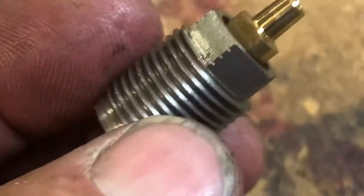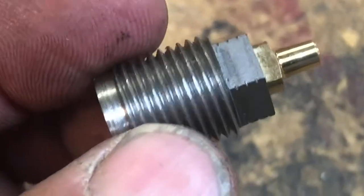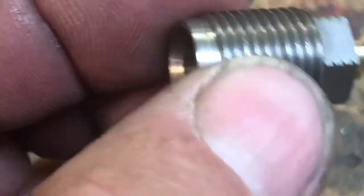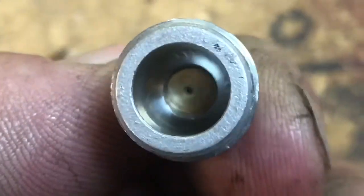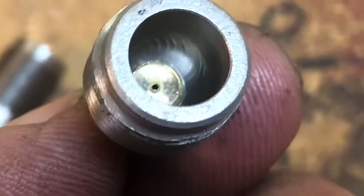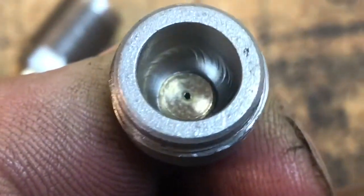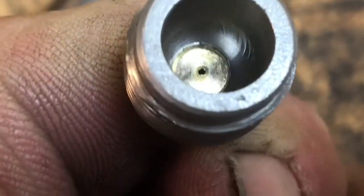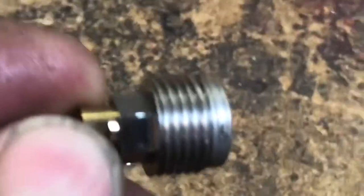Here's my design, where I recessed the nipple in and grabbed it with a half-inch flat. This new plug is made from 416 stainless. Let's see how we came out on threads — about the same, we've got about a half a thread there. And a little bit of a chatter mark, but not bad. White musket plug modification — there you go.